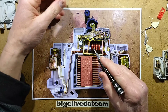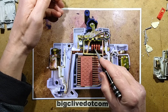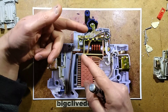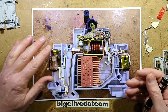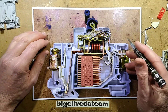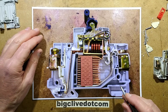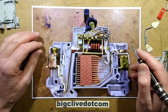This is a Type B breaker. The breaker type varies the instant trip threshold - not just related to current rating but to the number of solenoid turns. Type A has a quite low instant trip threshold; Type B is normal; Type C is designed to handle inrush currents like transformers; and Type D is for heavy industrial plant like large welders with massive inrush currents. A multiplier is applied to the rating to determine the instant trip current, and you must ensure the circuit can support that fault current to guarantee it trips instantly.